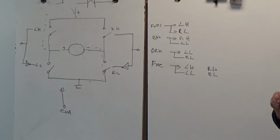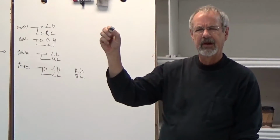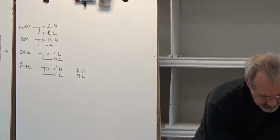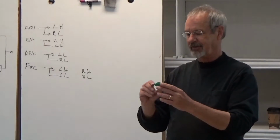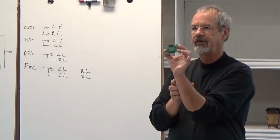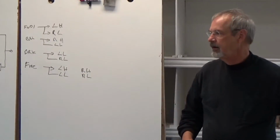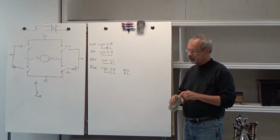This is an L298 chip, which is a very common, I think it's a 1.5 or 2 amp chip, something like that. So for the kind of motors we use, that's fine. And you can find lots of little kits out there that'll be $6 or $7 or something that have an L298 chip and some connectors and these high-speed diodes that you have to have for the switching transients and so forth. Well, you say we commonly use the 1 amp, but you gotta watch your stall current. So it's your stall current, not your running current. You gotta look at the current phase.